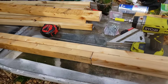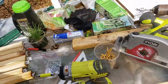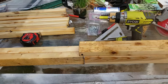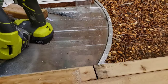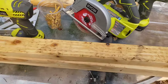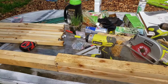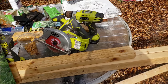Because that other one has that sag, I cut one piece of wood that spans just past both of those seams. This is going to add a little bit of additional support to the top of the beam — it doesn't have to be the full length, I just want it where the seams are so the seams don't let go.